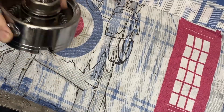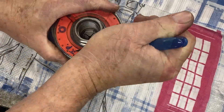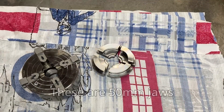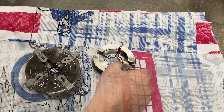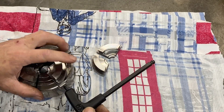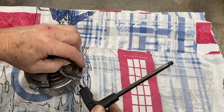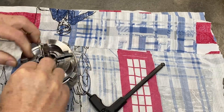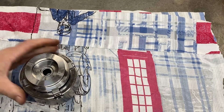The pinions go back in. I do a quick test with the chuck key, then the plastic piece and circlip go back on. I test out the slides, unpackage the new jaws, clean them up with acetone, and fit them on. I put the same-numbered jaws onto the same-numbered slides. Wind it into the middle and that looks pretty good.